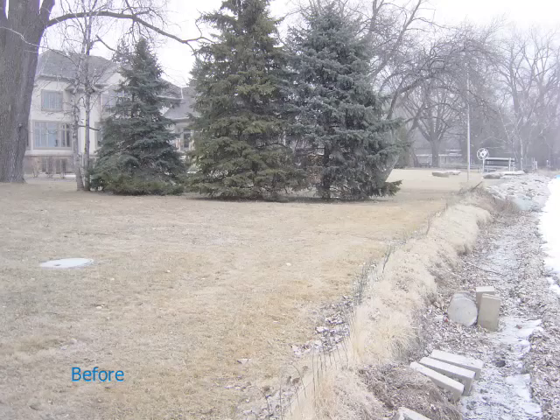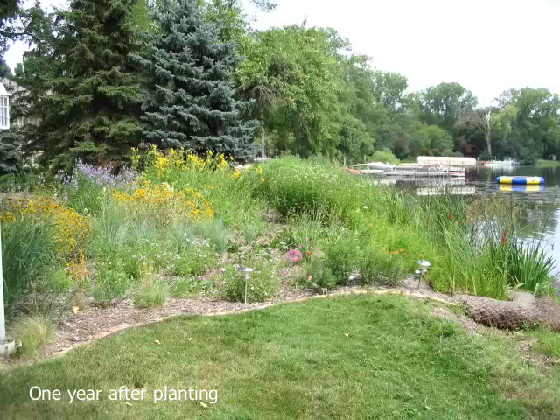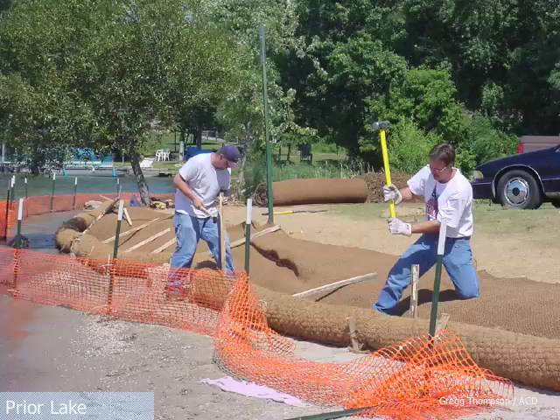This project in Arden Hills shows before, during, and after planting — one month after and just one year after. During the planting, notice that erosion control blankets are in the transitional area and biologs are placed at the toe of the slope, while snow fencing was tried out as a wave break. After several tests, it was concluded that snow fencing is not recommended as an effective wave break. Brush bundles or just biologs work better as wave breaks. To secure the biologs, stakes are pounded in every few feet on both sides.